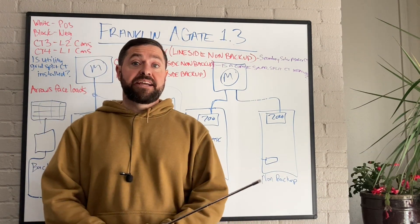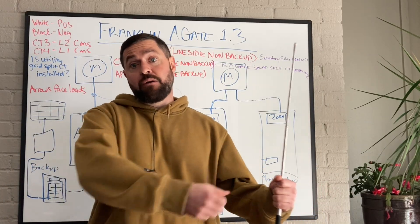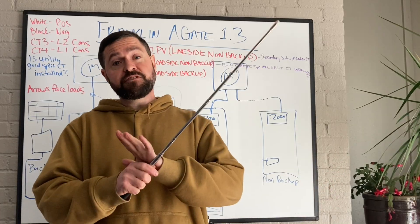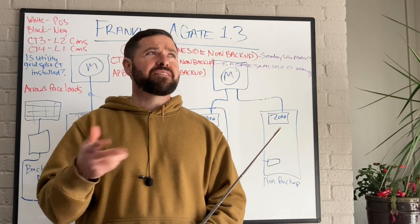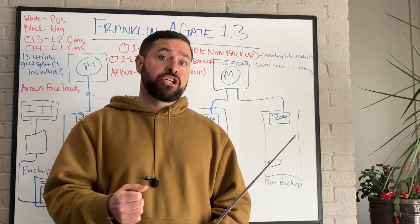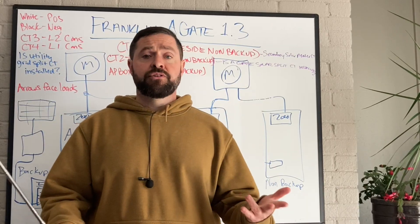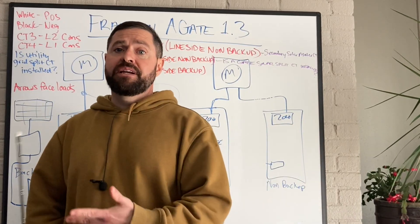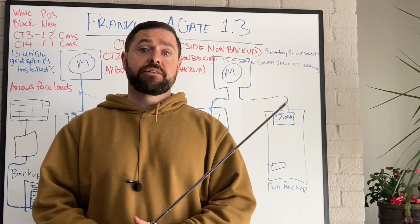If you ever need to go back out on site to regain access to the A-Gate — for power systems, when we gain site access, we take that monitoring system out of your portal and put it into our portal, so you no longer have access. When you get back on site, log in directly to the A-Gate using the last 12 digits of the serial number as the password. That will immediately log you in, take the system out of our portal, and put it into yours. When you're done, notify the QA/QC team and we'll reach out to Franklin to move it back into our portal. This is a common issue whenever installers return to the site on Franklin whole-home systems.